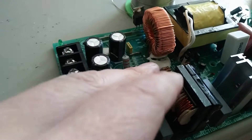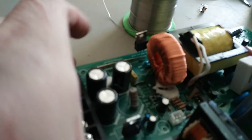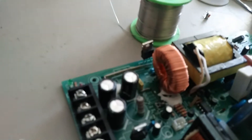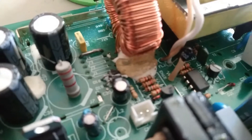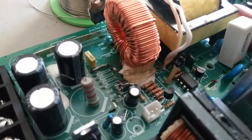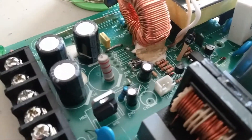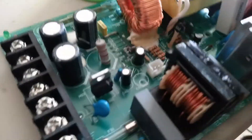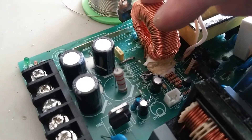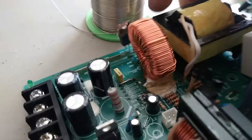The coil on this one was originally glued down but the glue ripped off and now it's just kind of jangling around in there, moving around a lot. So I'm going to put some hot glue on that before I put the new potentiometer in. I'm not sure how well that'll work compared to the original glue. It was kind of hard to get in there so I globbed it in — it wasn't really holding too well — so I used a soldering iron to rework the hot glue and that seemed to work pretty good. It still moves a little but it's not flopping around like it was.